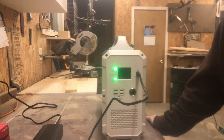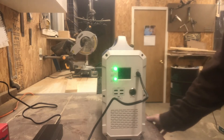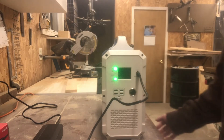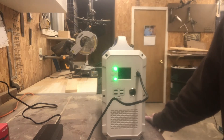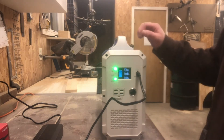You can get quicker charge times by hooking up solar panels. I've seen videos of people getting 300-plus watts. We personally bought two 12-volt 100-watt panels and hook those up from time to time. We're in the middle of timber so we don't get the best sun, but during the windows of decent sun we were getting just around 100 watts — which was enough, since most of the time we're not pulling more than 100 watts of output at any given time.